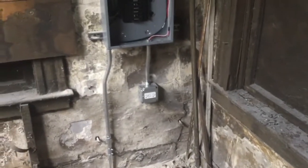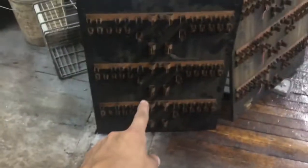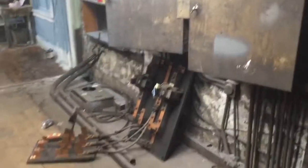We had electricians in - we've been waiting on them for a while, but they finally came. Not their fault, materials are hard to get right now. They put in our 200 amp three-phase panel, did all the work outside, and ran the ground wire to the water main about 120 feet away. These old panels can come off the wall now - we're keeping the decorative switch and boards. It's amazing that this one panel replaces the switch and the big box that was in the corner.